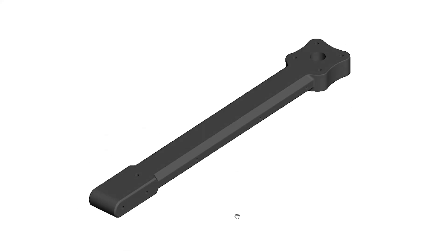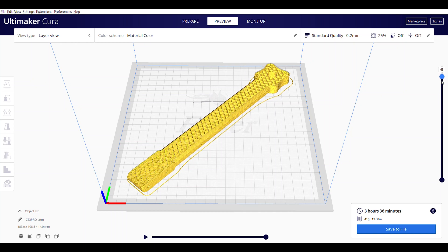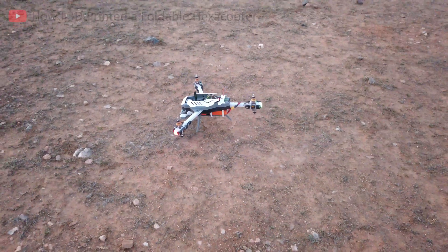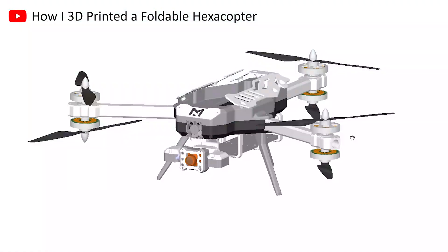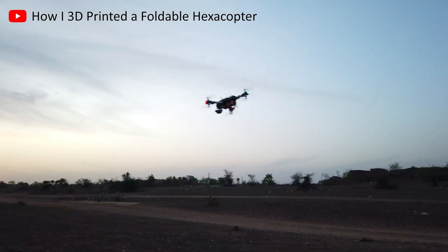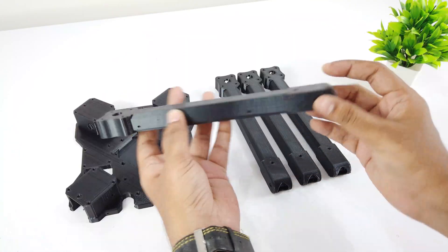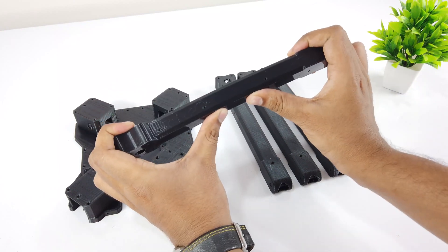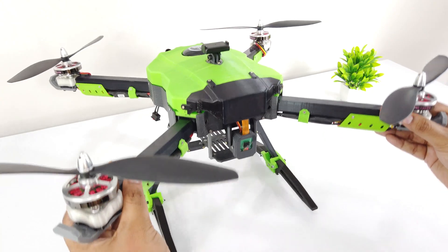The arms I designed are completely solid, and while 3D printing, the infill helps in filling the structure but doesn't provide structural strength, so the arms bend under load. In my Y6 hexacopter video, the frame was sturdy and achieved a smooth flight because of hollow sections in the arms for passing wires. I have now redesigned the bottom plate and the arms, and there is no bending on applying load. The drone is ready with some new features.